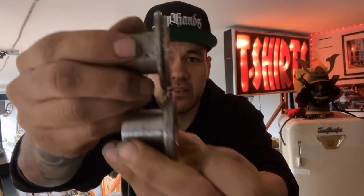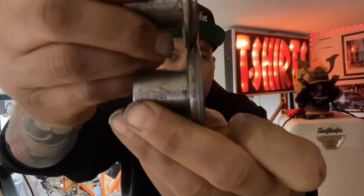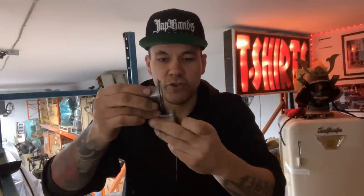So that's explaining that. As far as tipping the bead that went all the way around the panel, which is unfortunately the footage that we did lose, I just use these Eastwood tipping wheels. They've got this little step in them, and they work awesome. You're not fully pressing them to make the step, you're just pushing down and pushing up, making a little bit of a jog, and that's all that is. You can adjust them for the size of the jog by moving them apart or closer together.